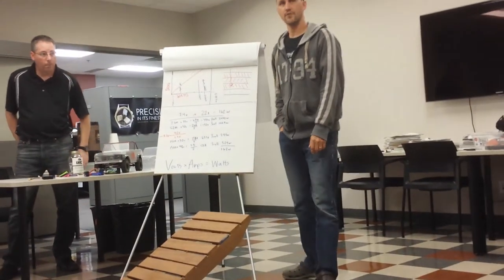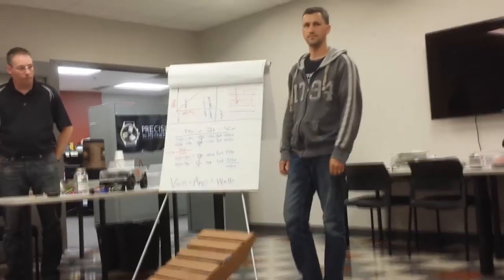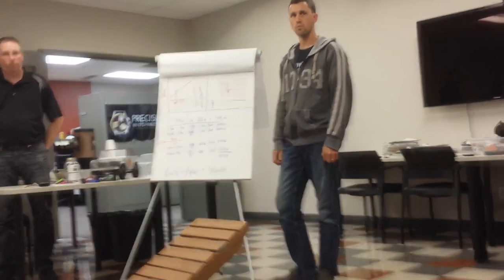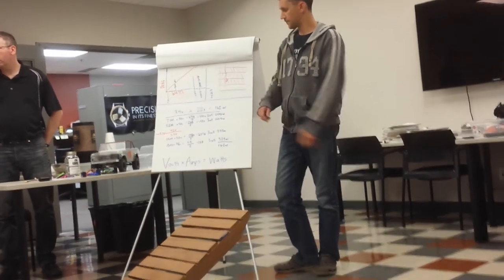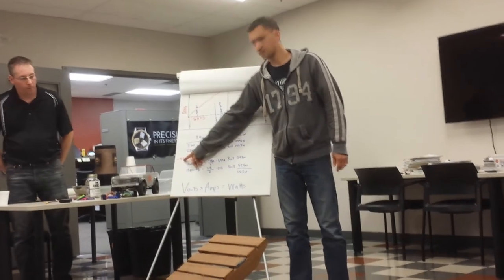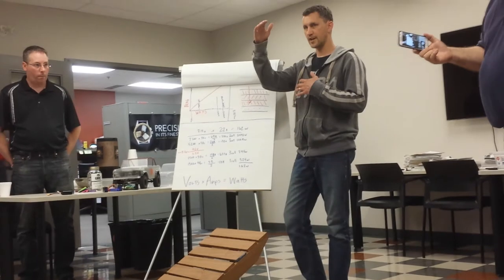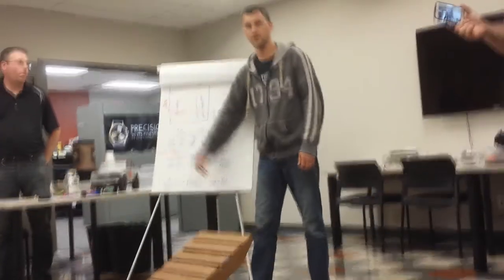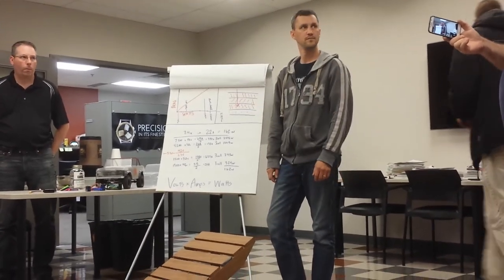If you have a bad cell in a battery, it's usually because it's overdrawn or it's crystallized. But technically, you're supposed to be able to store a battery and not really have any trouble with it. You draw it down to about 60-odd percent, 65%. If the polymer is good, you store them at 3.7, which is the nominal voltage for the cell. So there's no charge action, there's no discharge action. If it's sitting at its nominal manufactured voltage, it will last for years and years, and you'll have very little decay. Now, is that the same for a three-cell or two-cell?